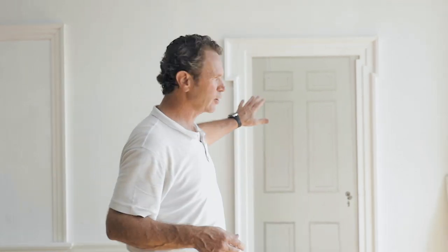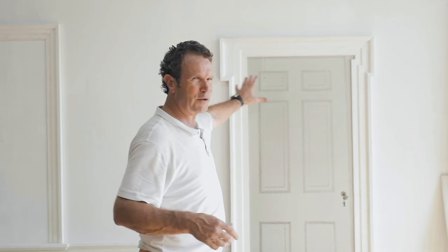So guys, we've played with the Georgian style today. We kind of fitted a room out, right? We played with a 10-foot tall room, and we played with hierarchy. We played with a lot of different moldings and details so that we could end up with a bunch of different things. Having this reference piece here helps us realize the sizes of moldings and how they come together. Hopefully, you now realize that you do not need to use 2-inch, 3-inch moldings because we really need to punctuate the openings. Hopefully, you realize now there's a couple different ways to cross-set your corners to elevate your room. Now adding a wainscot, right? Adding a chair rail. All these things elevate and enhance the beauty of your building and of your design.